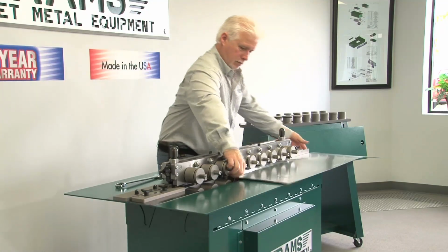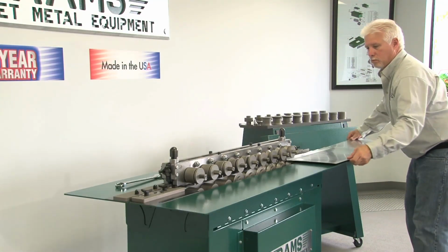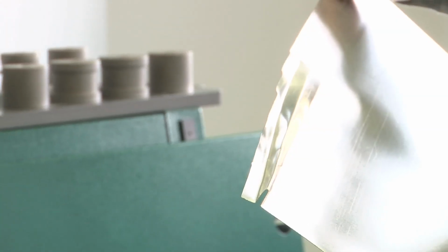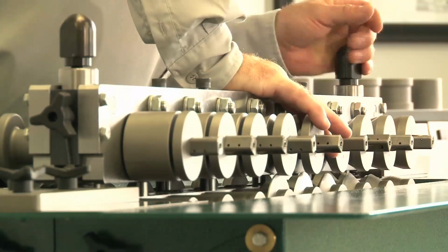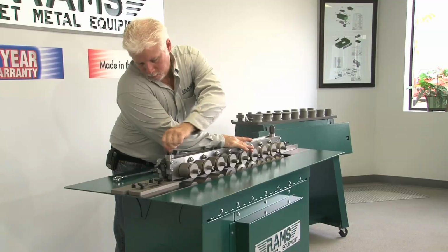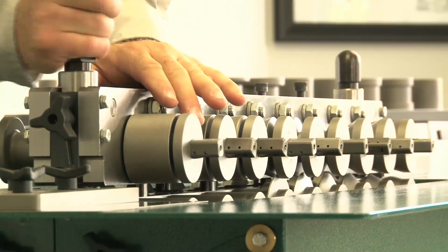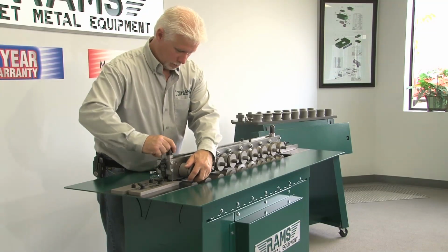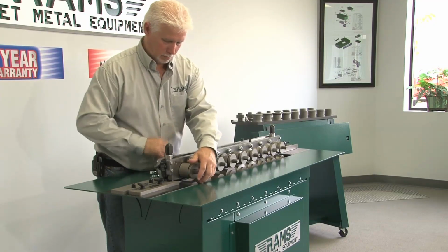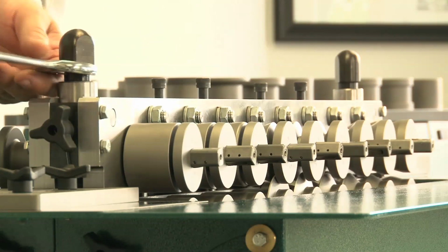Once enough room has been created, the metal is easily removed and the jam is cleared. Return machine to working condition by tightening down jam bolts simultaneously by hand, while making sure gear teeth are meshing properly. Occasionally, when the metal is pulled out, it will cause rotation of the shaft. If this happens, simply rotate the shaft by hand to align teeth. Be sure to check the gear teeth are properly aligned and fully meshing prior to tightening the top plate back down. This will avoid damage and prevent gear teeth from chipping.